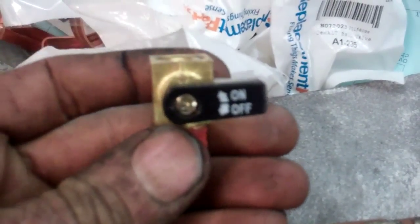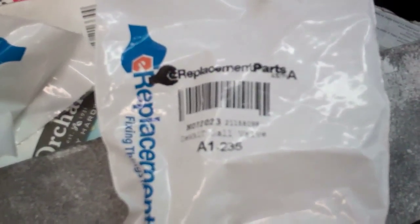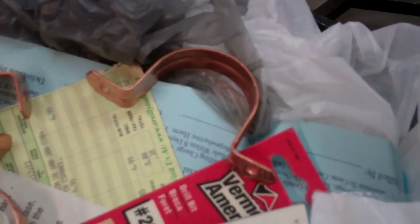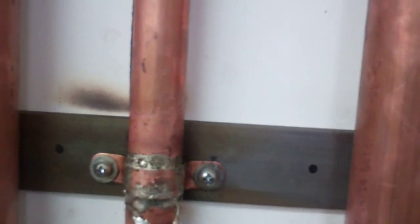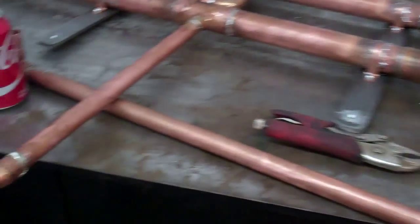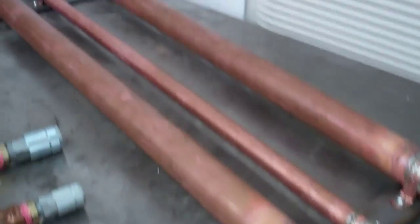I just got these drain valves — they're DeWalt drain valves. I ordered them from eReplacementParts.com because it's much faster to get them that way. I also got the inch and a half straps. They sell the pipe and fittings at Home Depot and Lowe's but they don't sell the straps — I had to go to a plumbing supply place for those. Each metal bracket I marked with a center punch so I can take it back apart, paint them, and put them back in the same places. I got the water trap finished, so now I'm going to take it apart and paint those brackets.